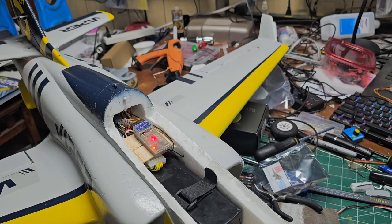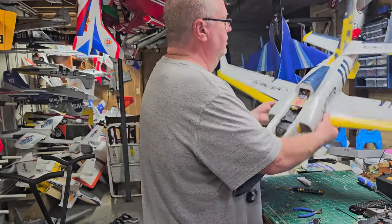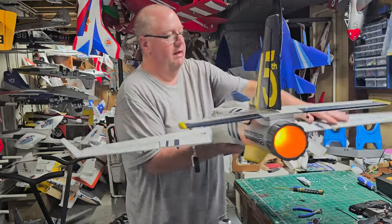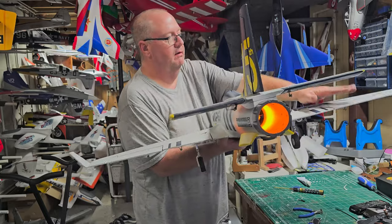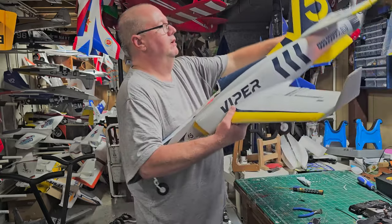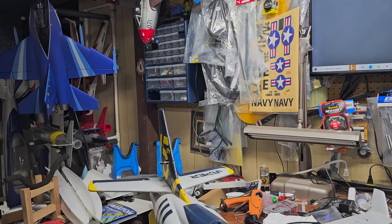The orange is on — my stabilization's on. Now what I want to check is the aileron. Let me turn the gains all the way up so they're over-exaggerated. When I lift up on this wing, this aileron should go towards me — but it's going away from me, so I've got to change that direction. The elevator — as I push up, it's pushing towards my hand, which is correct. But the rudder is also wrong. So there's a procedure for that, and it's not hard — you don't have to unplug anything. We know my aileron and my rudder gyros are going the wrong way.